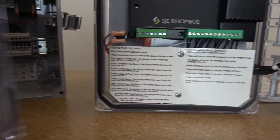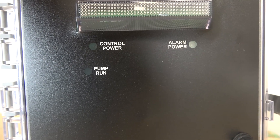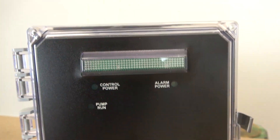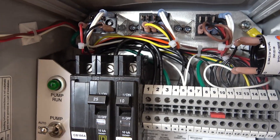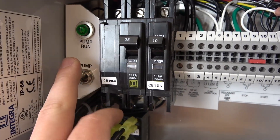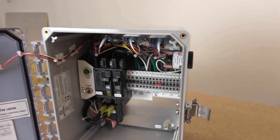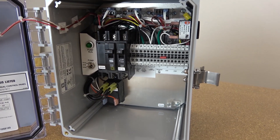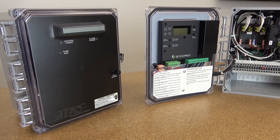Here's the front of the dual mode panel. You can see you've got control power lights, alarm power lights, as well as the pump run lights — one more tool to help with troubleshooting, plus the cool LED light. This is the simplex panel — this one has the pump run light located inside of the panel, and this one has the traditional HOA switch. This particular panel is your basic, more budget-friendly option, but not quite as versatile. So if you're trying to maximize your inventory in terms of versatility, I'd definitely be looking at these two dual mode panels.